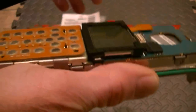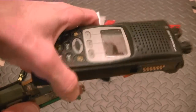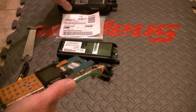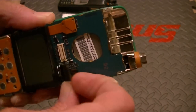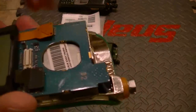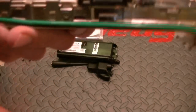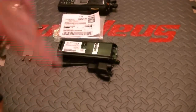Simply remove the flex like this and you've got the 5000. The good thing about a 5000 is you can work on it. The 2500 is not so much — 2500s have brittle flexes and they're difficult to rehouse. There's a tab here that you lift off and a tab here for the keypad. You disengage these two, and you need to watch this when you line it back up. You've got your LCD and your four tabs here on the keypad.